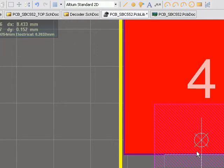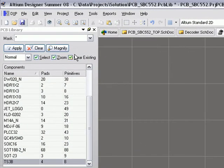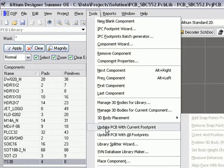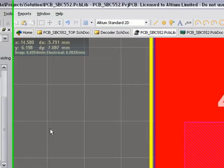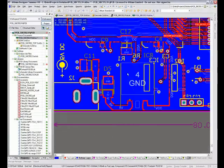I could go through that just to keep things simple, but I'm not going to worry about doing that right now. What I am going to do though is save the library now that I've updated it, and I'm also going to update the PCB board with the current footprint since I've done an update to the footprint. Now the PCB — you can see the asterisk there shows it's been modified.